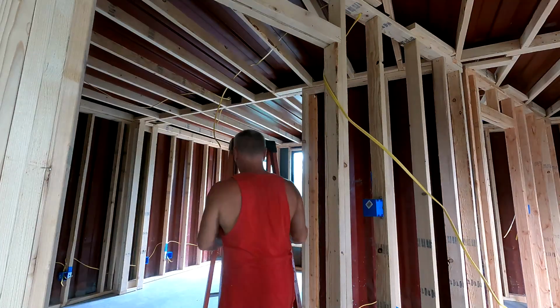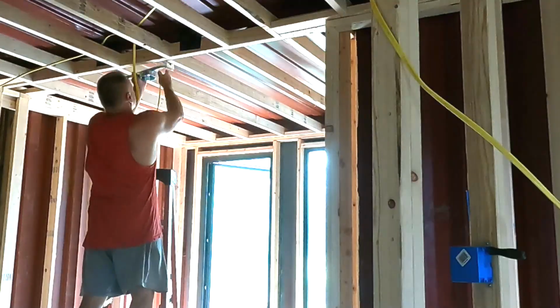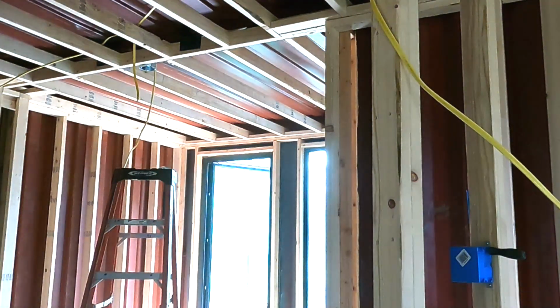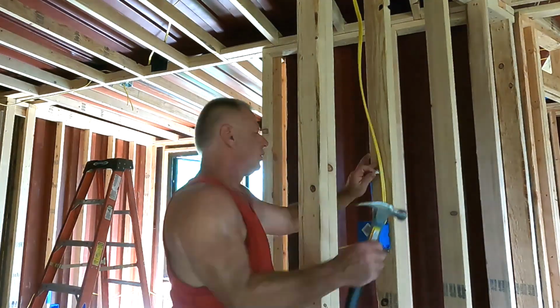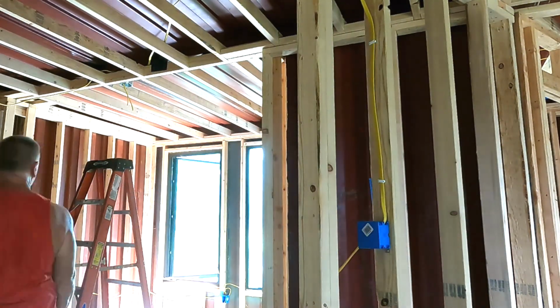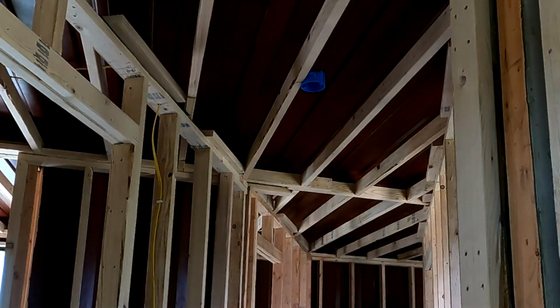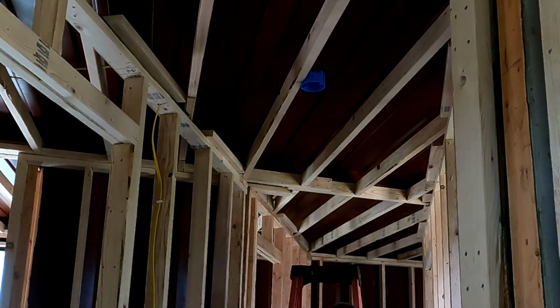As you can see, most of the wire I'm pulling to the switches is a 3-wire, depending on what we're wiring up. If it's just a ceiling fan or light, it just needs a 12-2. If it needs a 3-way switch, it's a 12-3, or other complicated configurations. So you can have a control line and then just the hot and the neutral to go with.